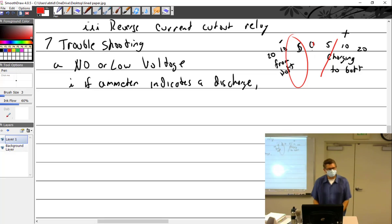You're limited. So zero charge, like even charging, means that when it hits zero, and it's always just a little bit to the positive of zero, you're trickle charging the battery. Basically, you're charging the battery, and the rest of the load goes elsewhere. The ammeter really tells you what is going in or out of the battery. That's all it tells you.